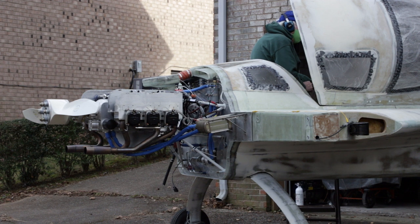Verify left fuel pump runs. And we hear it running back there, so that means the ECU is active. And the fuel pressure comes up to about 3 bar, 43 psi. We're showing 40 today when the ECU turns off. So we're going to do a key switch off, and then we'll select the other tank and key switch back on.